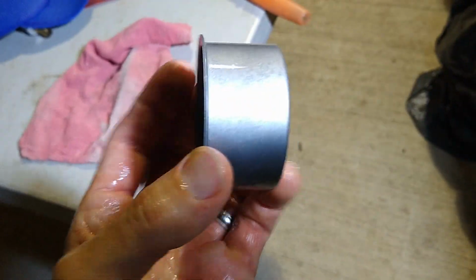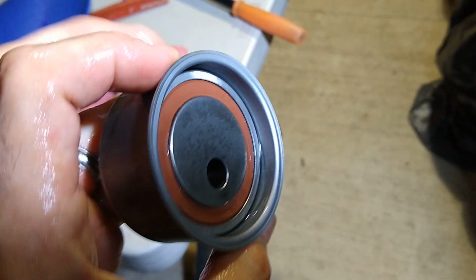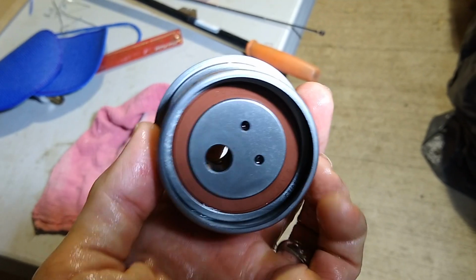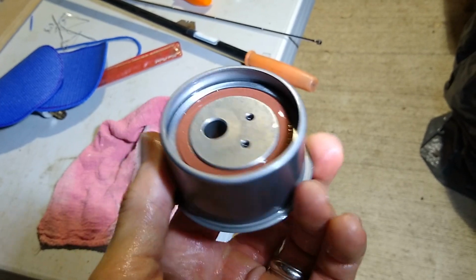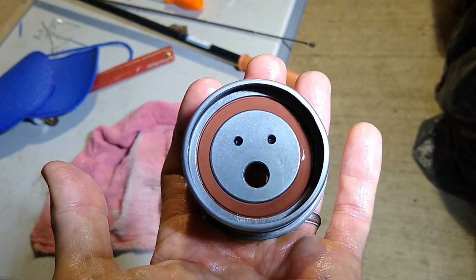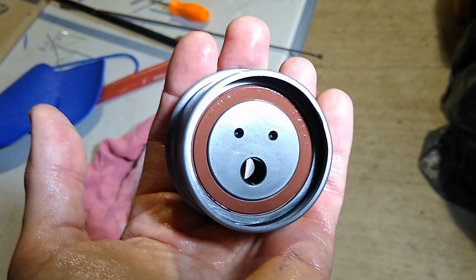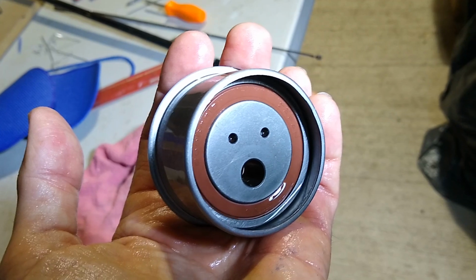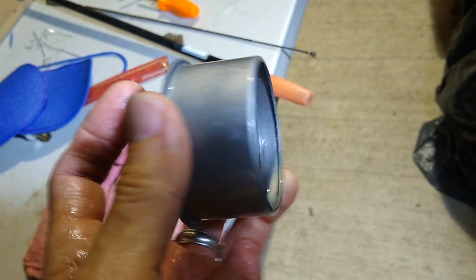Did it work? Yeah, it did. It's a little slow because of the 6mm nozzle, but it does work. And that one was 3D printed. What I'll do is I'll include that file in the description. That way, if you guys have a 3D printer and you want to print up one, you can. Just remember that you have to tap the holes in the back with a 1/2 inch tap. It's a pipe tap, so it's not a standard tap, it's a pipe tap.